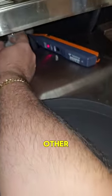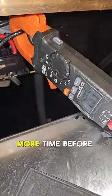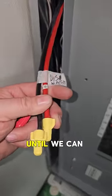As well as confirm there's no other damage on the circuit. Now that I've verified exactly which circuit it is, I'm going to check the amperage one more time before I disconnect the circuit and save it off for the evening. Tomorrow I'll install a new 50 amp breaker in a different location until we can repair the bus bar.